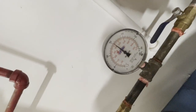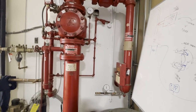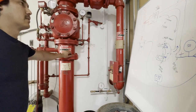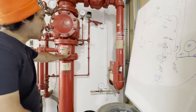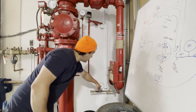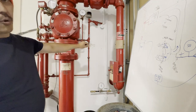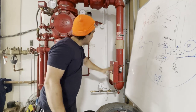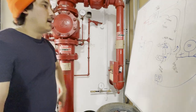You can see that we are holding pressure. When I'm done my two hours — this is a 15-minute video in right now — after my two-hour test is done I've got a check valve here keeping the pressure in. I'll probably just go outside, open up my two test valves, drain the water out — it's going to drain from this check valve back and out — and then disconnect my test connection.